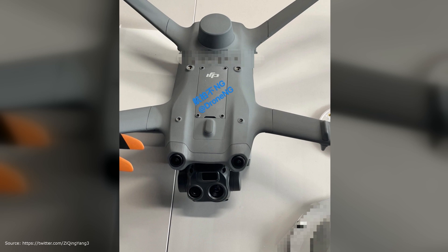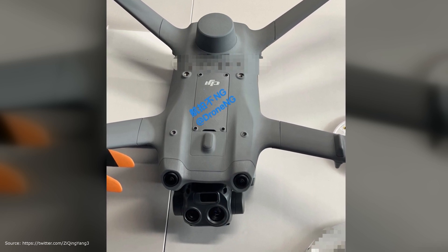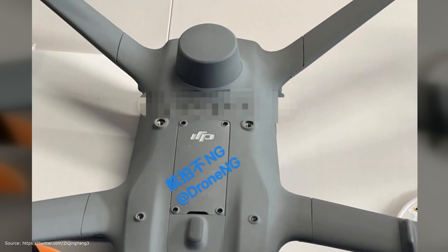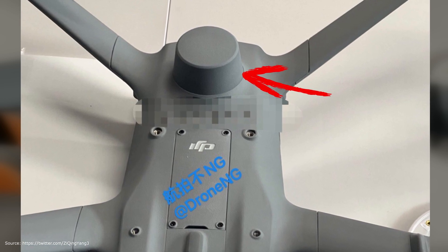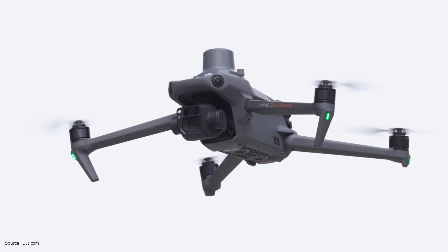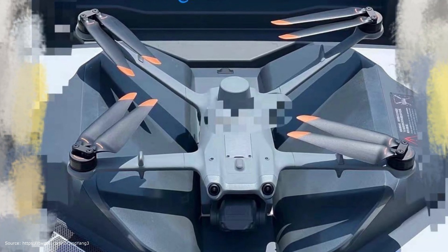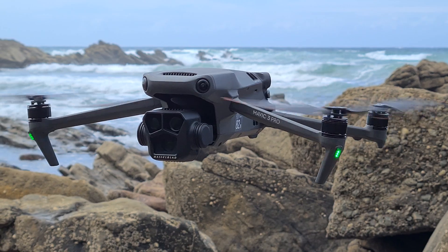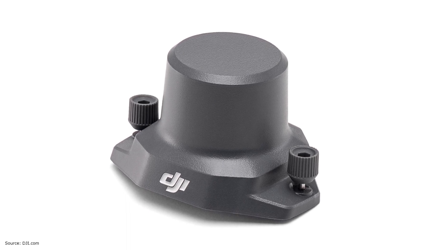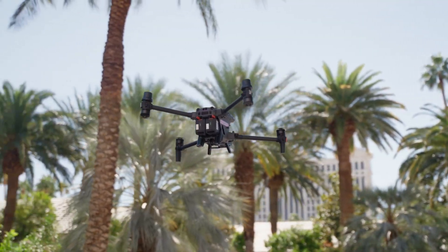Again, we can clearly see that the arms of the drone cannot be folded or unfolded. Many things indicate that this will not be a solution for individual use, but rather that the dock seen in the other pictures plays a crucial role. At the rear end of the drone, this round unit is the so-called RTK — real-time kinematic module — which we already know from the Mavic 3 Thermal. This technology allows for more precise locating; position data determined via RTK is significantly more accurate than navigation with a pure GPS receiver. This module increases the accuracy of measurements, but also that of the fully automated landing process, which again suggests that it is a fully automated system.